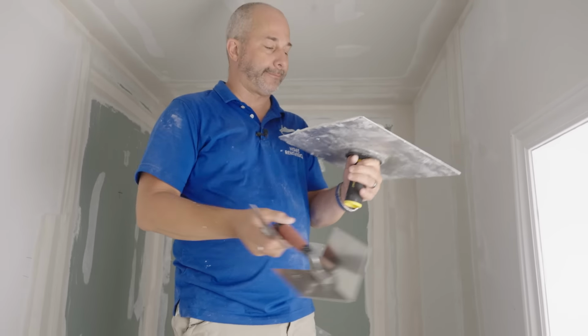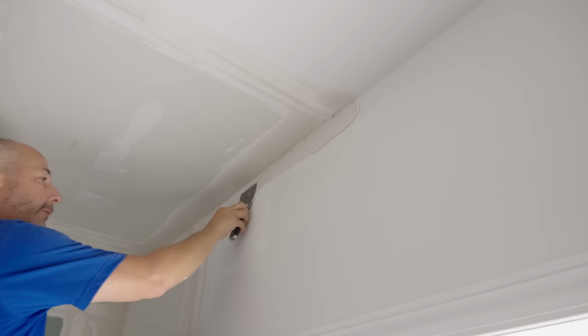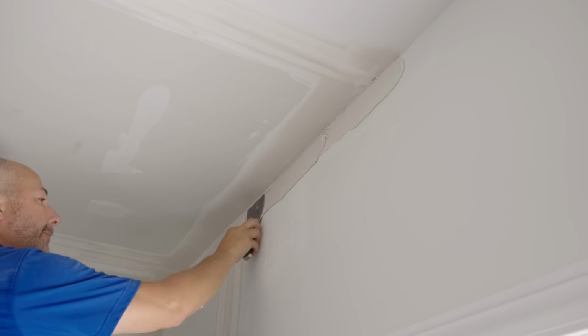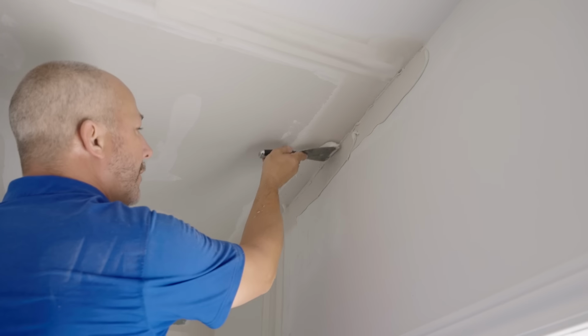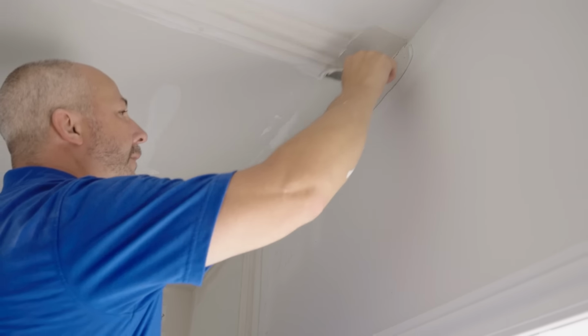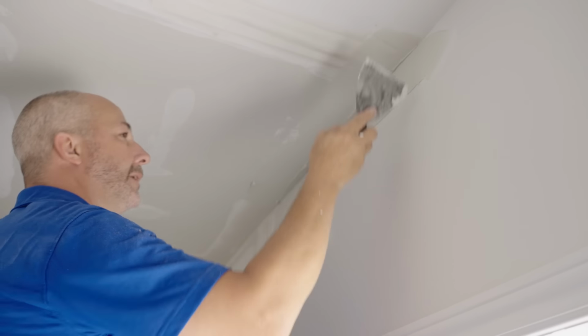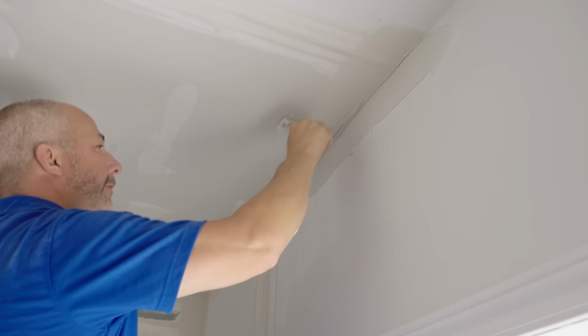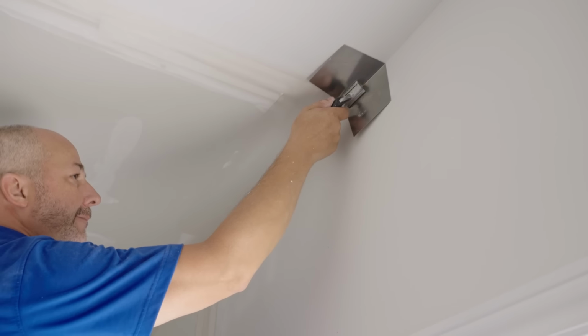It's an inside corner trowel. I'll demonstrate right here for you. So basically you're gonna put some mud on the wall. All right, both sides of the corner. All right, there we are, nice and gooped up. And you're gonna wanna feather off the edge, okay? And then you can take this trowel and do both sides at the same time.